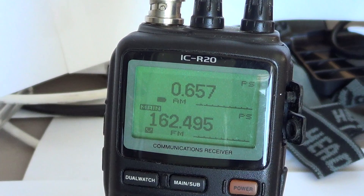Another example: repeaters. Lots of amateur radio repeaters — most repeaters — have an offset, a 600 kHz offset most of the time, either higher or lower from the main frequency. That gives you the ability to listen to both the input and output of the repeater, and it gives you an idea which amateur radio stations you can hear direct and which ones come through the repeater.